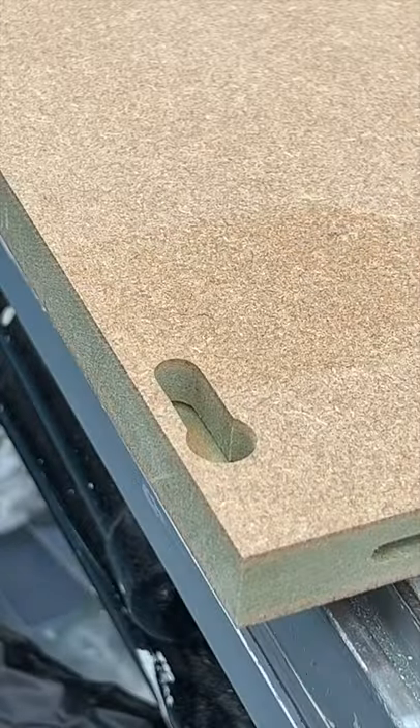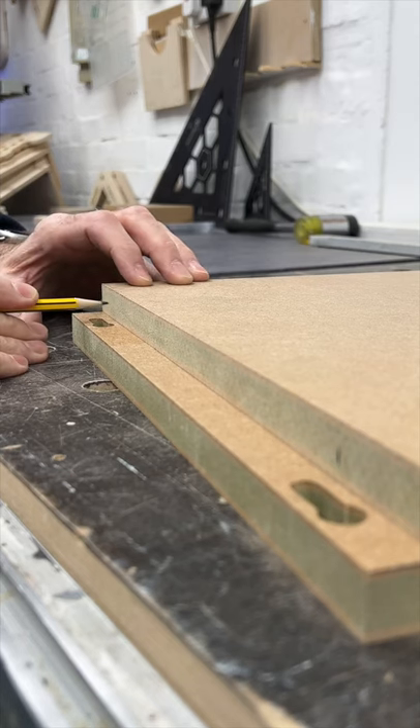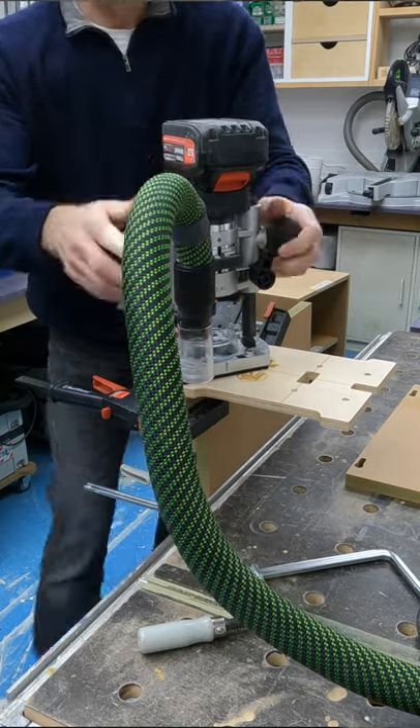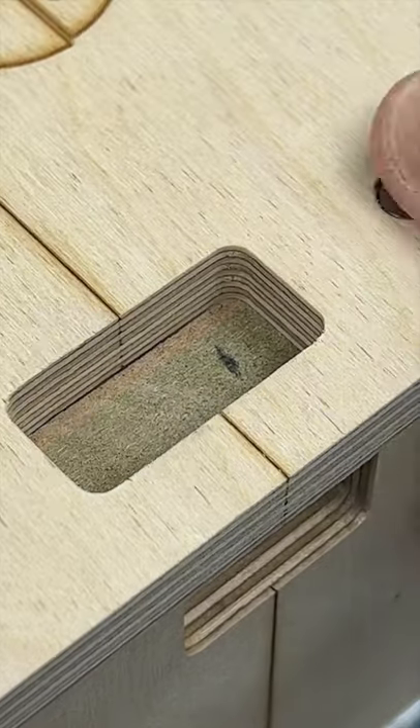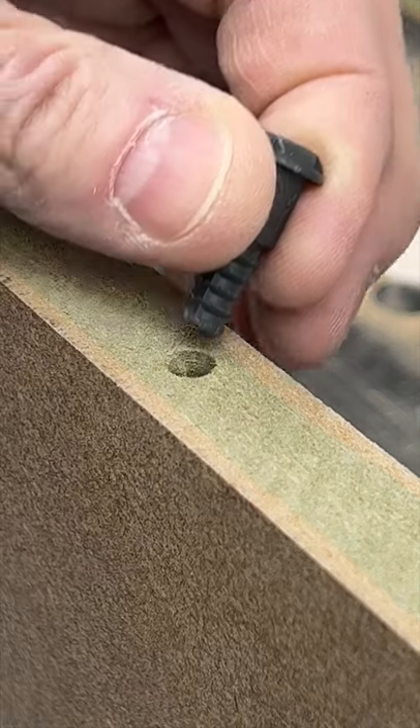You don't get the little peanut-shaped pictograms on this jig of course, so I'm getting this straight in my head by marking on the edge of the board where the keyhole cuts end, then using a 6mm bit in another router. There's no drilling guide at the moment, but I can drill for the Peanut fittings, making sure that I'm at the correct end of the slot.